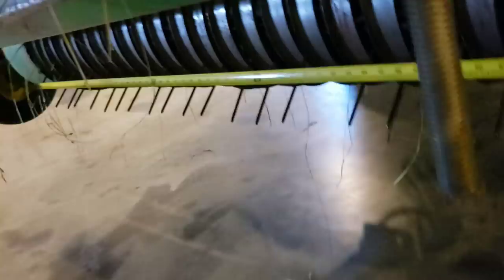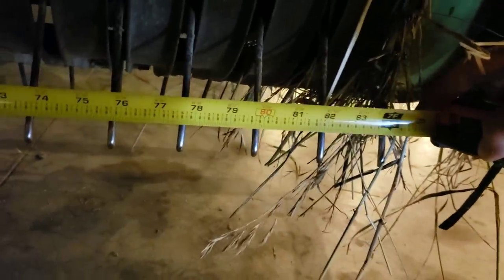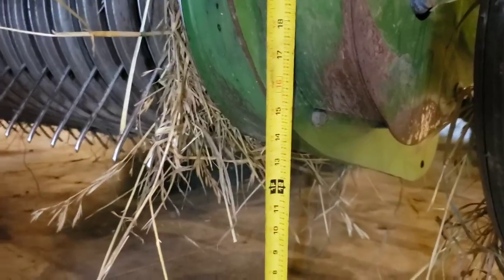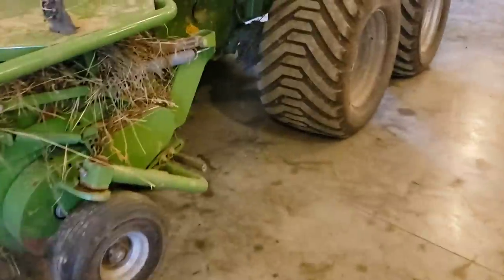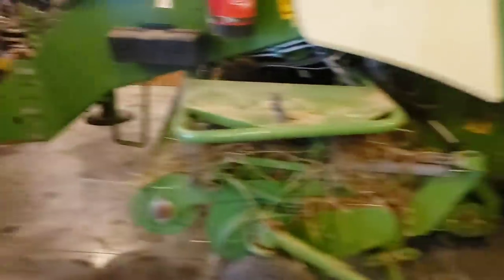The John Deere pickup is 76 inches from outside tooth to outside tooth, and the Krone is 84 inches — measured the same way. The pickup height on the Krone at the lowest point of the bands is about 13 and 5/8 inches, whereas the same measurement on the John Deere is about 16 inches, so it actually raises a little bit higher. Both cylinders are at full stroke, so both headers are at full height. The only variable would be the bolt hole increments of about one inch.